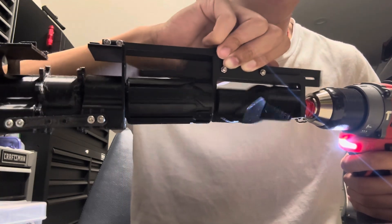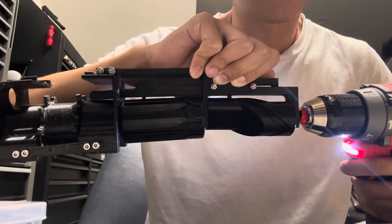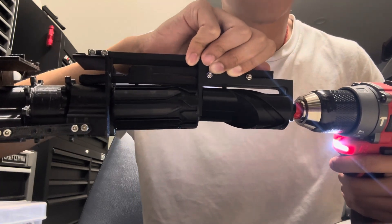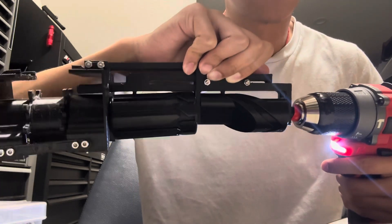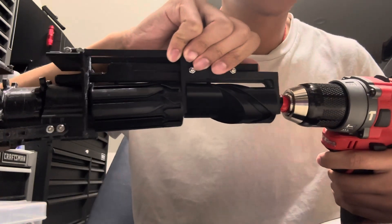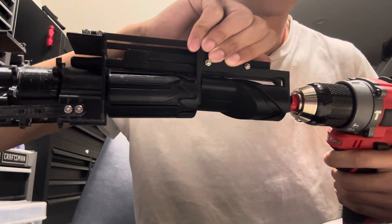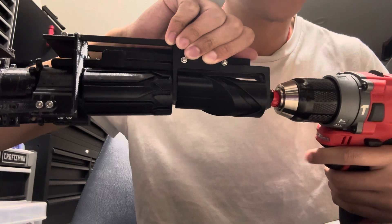There's a lot of flex because of these printed bars — they're not thick enough and don't provide enough support, so there's a lot of flexing everywhere. This also leads to everything catching and binding down here. The cam is also being redesigned and reprinted right now.